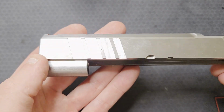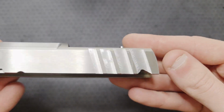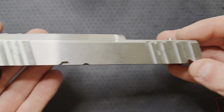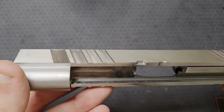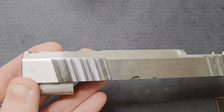There were minor machining marks in all of the cuts and chamfers I made around the muzzle. I could barely feel these, so they were probably no more than 2 thou deep. The mill I used doesn't have a VFD, so changing RPMs means changing belts, and that's a pain. I ran all the end mills at 1600 RPM, which probably wasn't too good for the larger diameter ones. I traveled slow but don't have power feed, so it probably wasn't very constant.